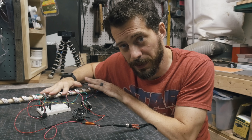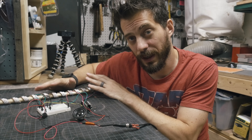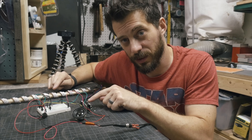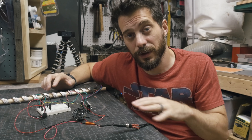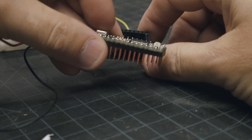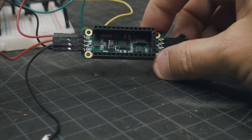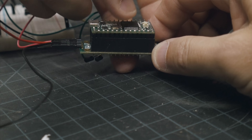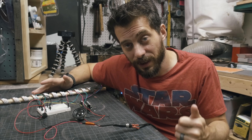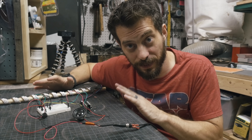I've got a strip of RGB LEDs wrapped around a dowel rod — they'll be permanently attached later, but this should give me a pretty even distribution of light. That is connected to this controller. This is a Teensy board — this is the 3.2 if you're interested. It's a very small Arduino-compatible board with a lot of features. It's plugging into something called a prop shield, which is an addition to the Teensy that adds even more functionality. This particular prop shield has an LED driver to drive the blades, a motion sensor, and an audio amp. So just in that add-on, we're adding basically all of the features of the lightsaber.